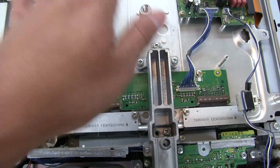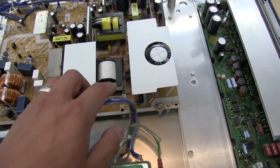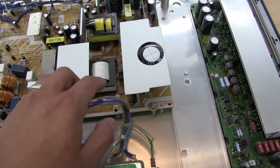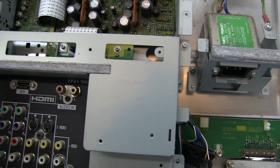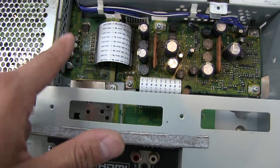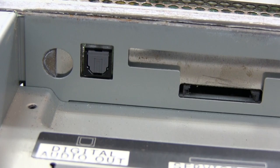We've got some drivers — these would be for the column drivers — and there's a filter right here for the input that's a little rusty. The main power supply is in that section; these are switching power supplies, so they are a little dangerous. You have to be careful that some of these aren't still charged. There's also what looks like a power supply board for the processor, and the main processor is probably up here — unless that's just for input and cable decoding. We also have an optical audio output right there.